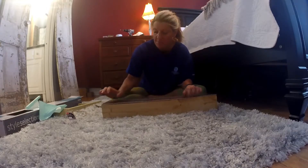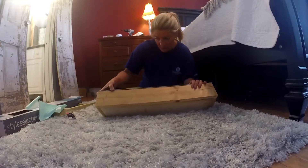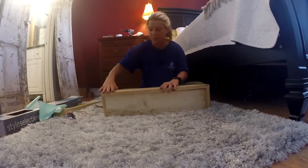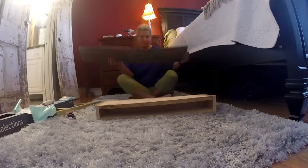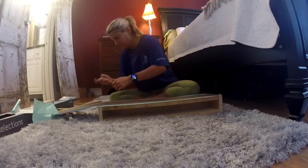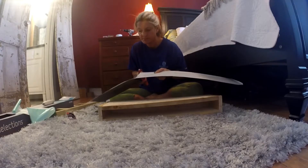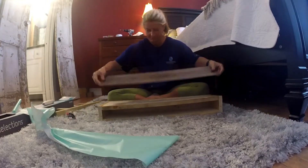That part's done. Now you're going to do the other side. Because I didn't want my nails up against the edge, I'll turn my hot glue gun on before I put my piece across the front. I will shoot hot glue in all those spots and press it down just to hold it, because this stuff is not sticky enough to stick to this wood on its own. Then take my other piece for the top or bottom, mark it, and cut it.